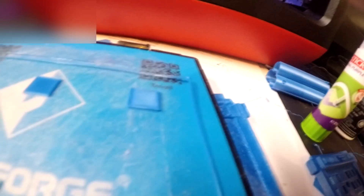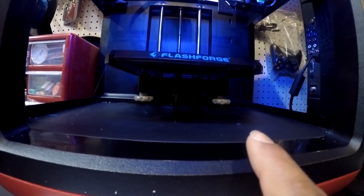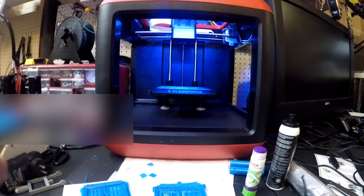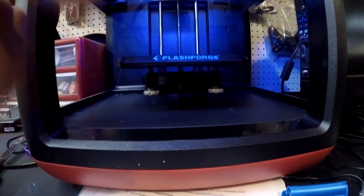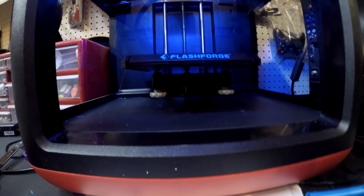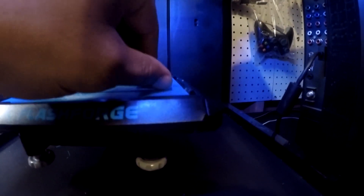The other option - if it's warping, then it has to do with the leveling. On my Flash Forge Finder, I leveled this thing probably about 10 times and I'm getting closer. I'm not following the Flash Forge Finder exactly when it says okay - there are three pins, we want to tighten all these guys up all the way and then simply wait until it hits the sensor at the top and it says the left side is good, the right side is good, the back is good. On the table I'm printing on there's a minor slant, but I can tell right here in the front that this area is down, which is going to cause this little warp effect to cause it to go up.